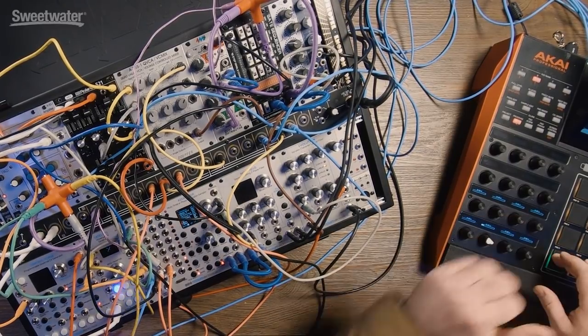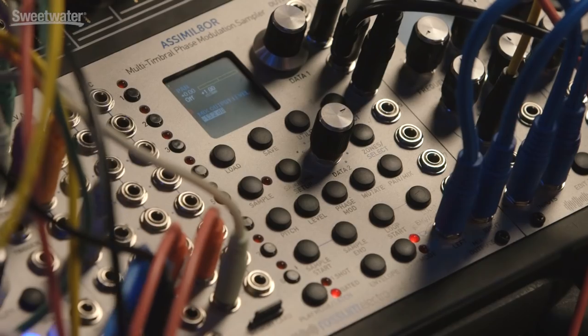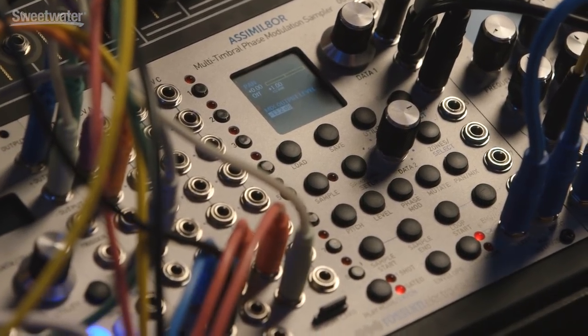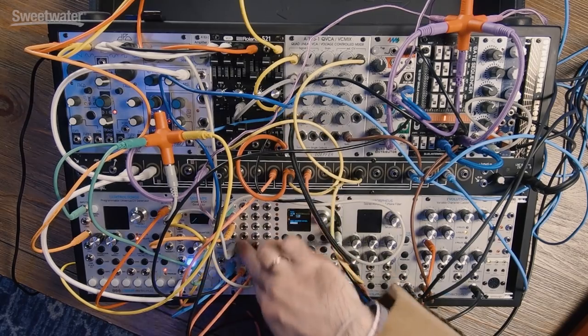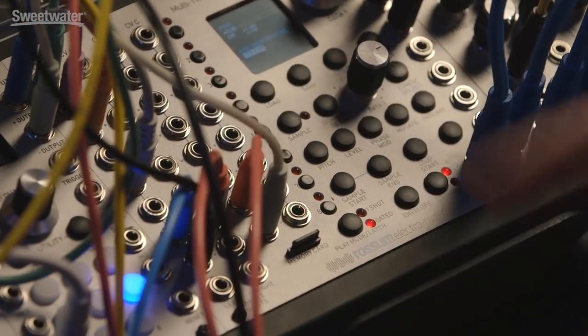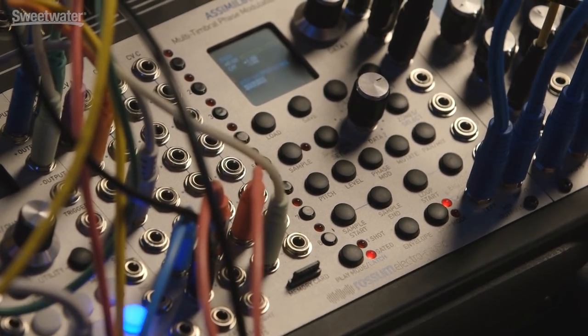Lots of fun. Now let's take a look at how we got here. Let's start by familiarizing ourselves with the layout of the module here. At the bottom, we've got our sample inputs. It's a sampler. This is where we plug up our audio or our control voltage signals that we're going to record. We've also got our gate trigger inputs here along the left-hand side. And then we've got 24 different CV inputs for controlling different parameters on our channels.